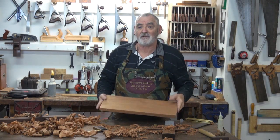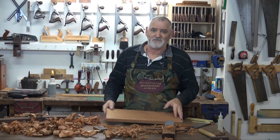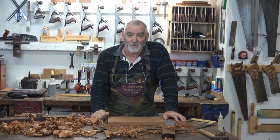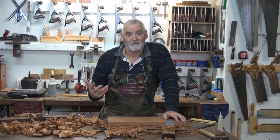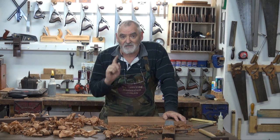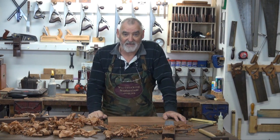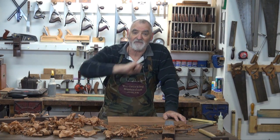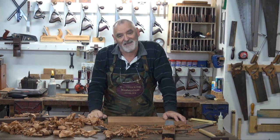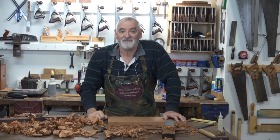So that's how you join two boards together — get the grain direction running the same way, and if you're using the same piece of timber you get the same grain pattern as well, which is good. All done with hand planes. In the next video, I'll show you how to flatten a board that's warped, twisted, cupped, or bent, and for that we'll use some specialty planes — I'll show you how to make one yourself out of a simple number four Stanley. So until next time, this is Steve pulling the shed door down — remember to keep it sharp, and more importantly keep it safe. Enjoy your woodwork and be kind to yourself. Bye for now.